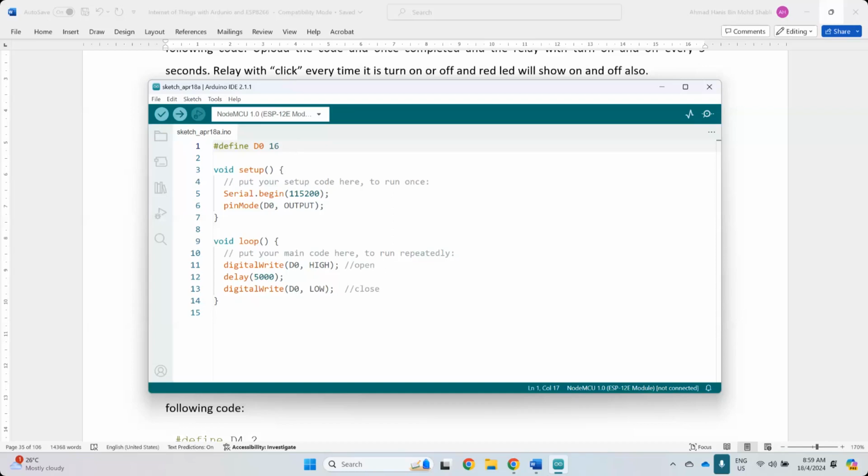But if you have more than three, you can use the power line here. The top and bottom down here is the power line. It's basically connected. All the negative pins up here are all connected in one line. So you can just connect 3.3 volts to the positive and ground to ground. Then all the top and bottom rails, if you connect them, will get 3.3 volts and ground. So it is easier.